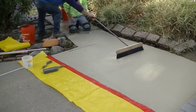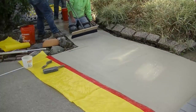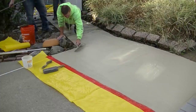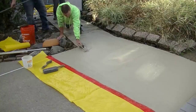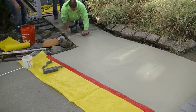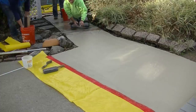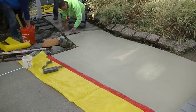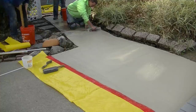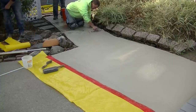We're going to do something special to the surface of this one when we're done — I'll tell you about that right at the end. You could definitely just leave the surface like this with this product and just put a regular acrylic concrete sealer over it and it would be fine, but we're going to do something a little bit more than that. If the concrete behind you starts to dry out, just keep lightly wetting it and make sure it stays damp — this stuff is going to trowel on a lot easier.